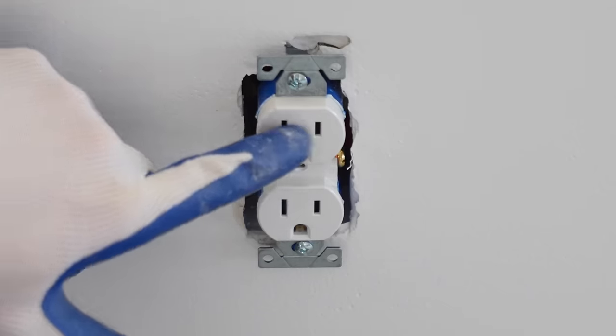Now I'm going to finish installing the fan that we wired up in our How to Wire a Garage video. To finish this off, I'm simply going to take the fan assembly and it's going to go into the housing. As you can see, these line up with these holes here. And then we're just going to clip it into place. Now that that's clipped into place, I'm going to take my needle nose and hold this housing on this side because it will want to push up on me. I'm just going to grab this first, then just hold down and plug it into this little receptacle.